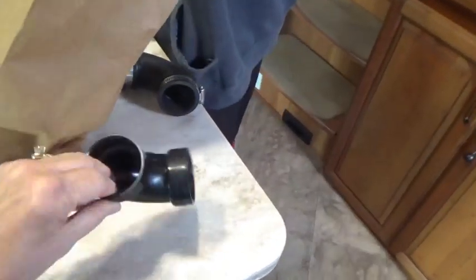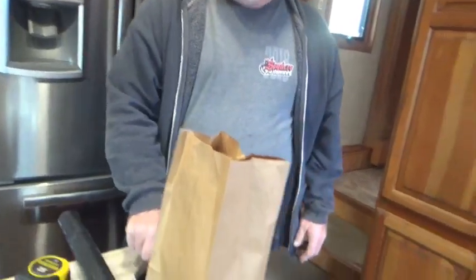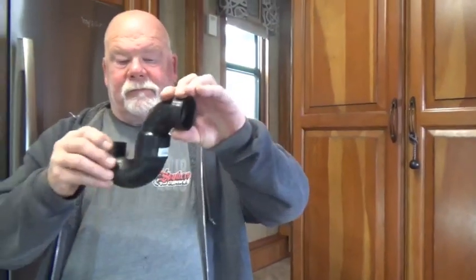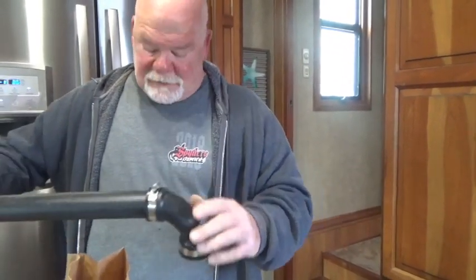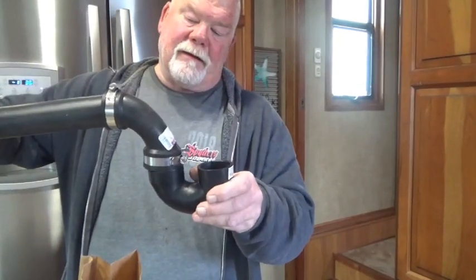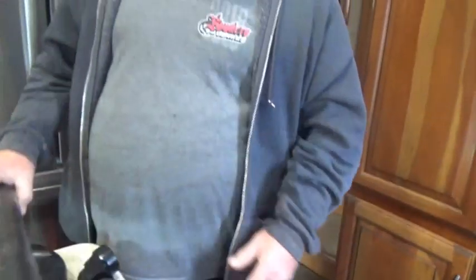Got that. Is it two-inch? One and a half — it's one and a half on the inside. And a glue trap. No screw-on stuff. I got this to go on the pipe. Trap goes like that — standpipe for the washer discharge. It goes like that. And I got this cement glue for drain, waste, and vent ABS pipe.